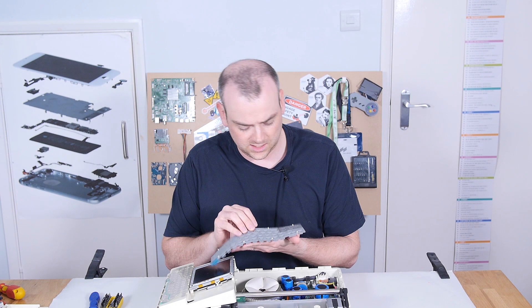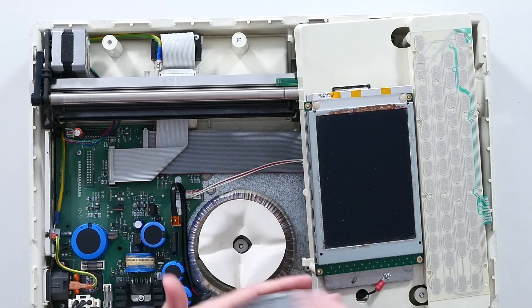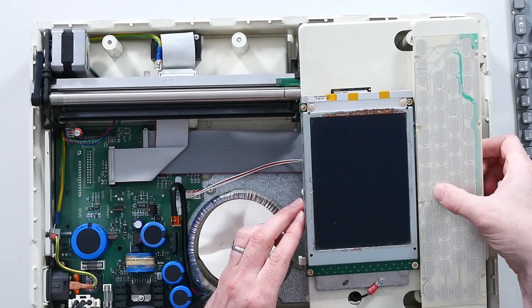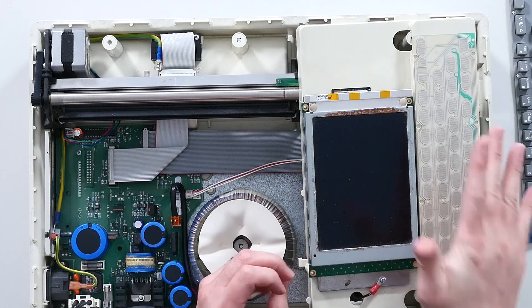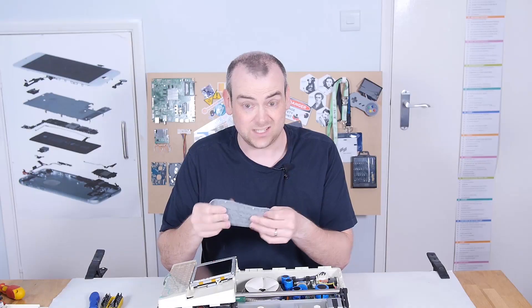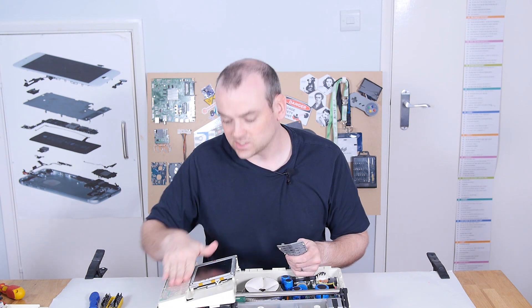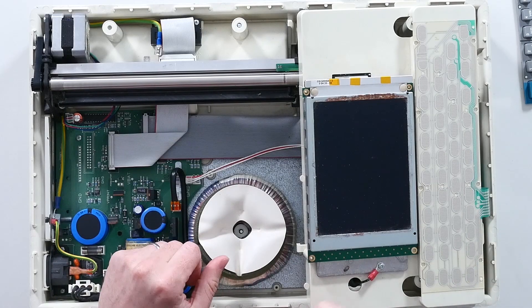I had really expected this to be a membrane keyboard in the style of rubber membranes with carbon on the back pressing down on exposed pads. But it's got an encapsulated dual-layer membrane keyboard. I would think that's probably related to infection control — in medical environments, you have to make sure everything can be cleaned. The fact that this is sealed away from the electronics meant it could be disinfected if need be, and harsh cleaning chemicals wouldn't get inside and affect any conductive components. That's our first sign of something specifically medical.